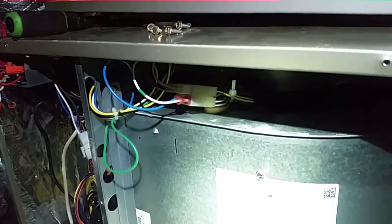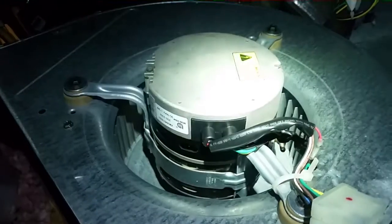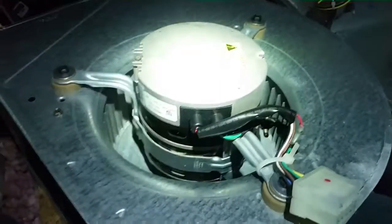It's got power to the harness — high and low voltage — and the motor is really hot. I just shut it down and I'm gonna give it a few minutes for the capacitors to discharge so they discharge into the capacitors and not into me. Then I'm gonna take it out and look at it. This is our Broad Ocean fan motor — it's hot to touch and I've disconnected it.